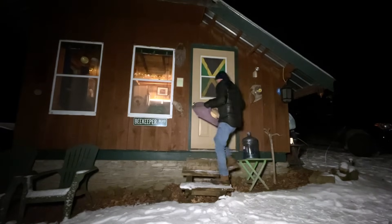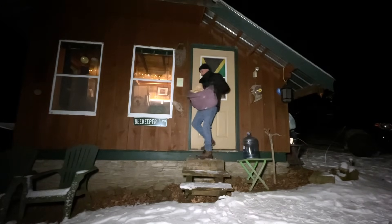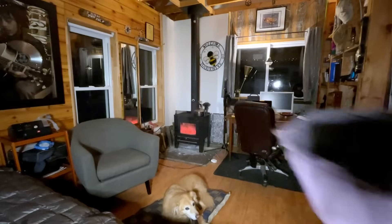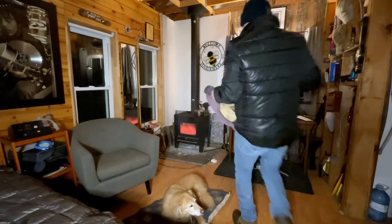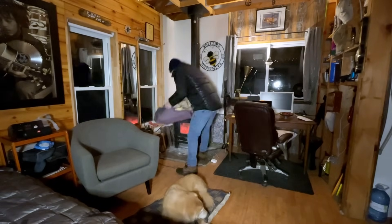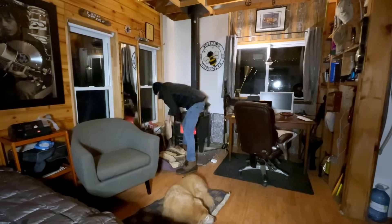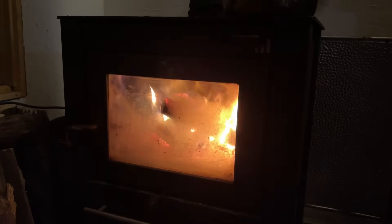So if I'm up here just for a night or two, just as a quick hitter, I want to make sure that I've got power right away as soon as I'm up here at the cabin. My AGM batteries will always be charged up — assuming I've got sun to do that — and waiting for me here with a hundred percent of its capacity, or 50% of its usable capacity. That's a big consideration, and I really think people should do some research, especially if you're in Canada.